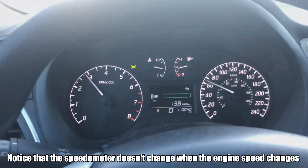The first experiment was a huge success. The scale allows us to see the torque progression increase as the speed increases, and we were able to find out just how much torque we were getting on the other side. Now for the second experiment: a really big downside to fluid couplers is that they tend to generate a lot of heat, especially under load. When there's a big difference between the speed of the input shaft and the output shaft, there's a lot of fluid friction going on inside, generating a lot of heat. This is actually a very big reason why a lot of automatic transmissions die.